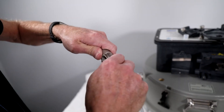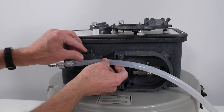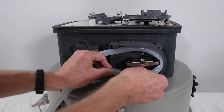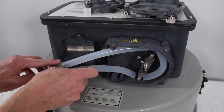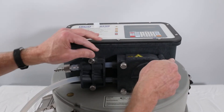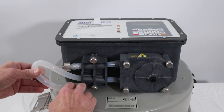After reattaching the tubing coupler to the new pump tubing, carefully align the pump tubing past the liquid detector and into the pump rollers. It can be helpful to manually rotate the pump rollers to best align the new tubing. Reinstall the liquid detector cover and the pump housing cover and feed the remaining tubing down into the center section.